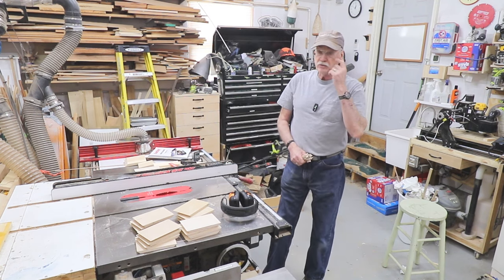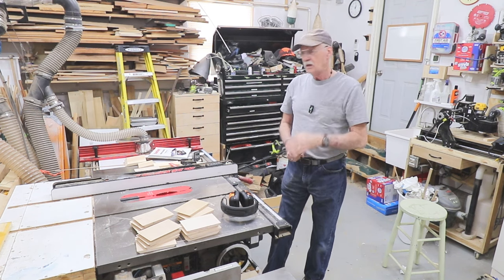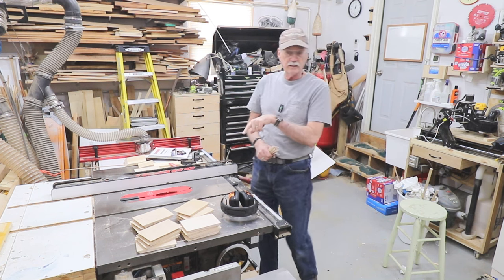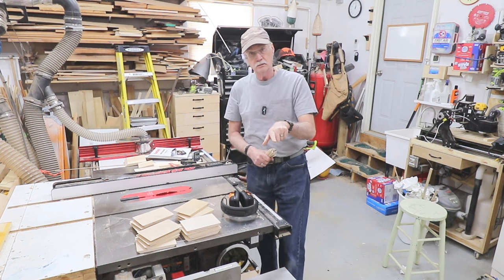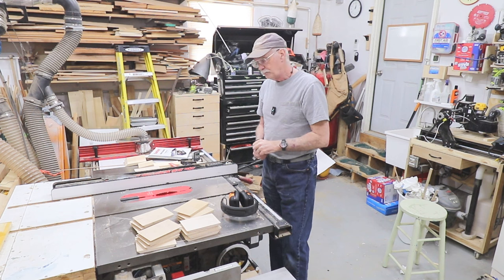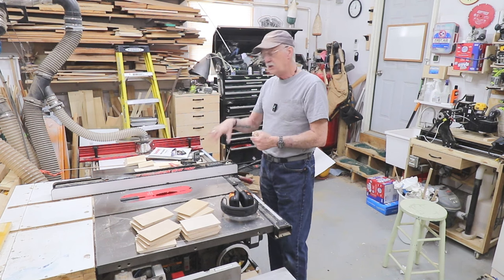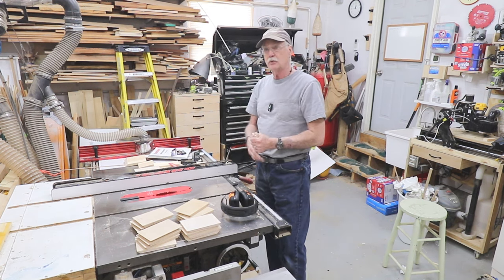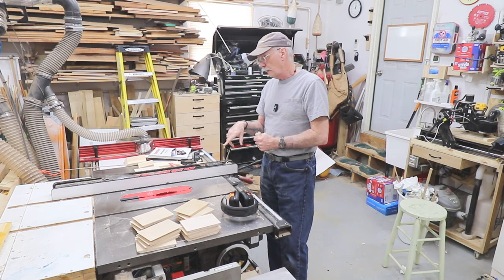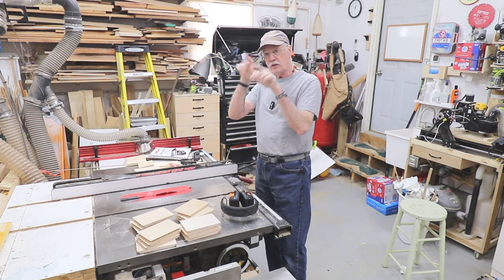Now all four sides for all four boxes are ready for the initial glue-up, which will be just folding it in on itself, gluing and pinning the boxes together and indexing them to make sure they're all square. I also have to do the tops — they're going to sit down inside these boxes out of another piece of plywood. I need to put the saw back up and bring it back down because I have to cut those strips out first and then do the angles on them. I also need to cut the corner blocks that are going to be used for added strength on the inside.